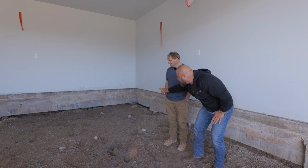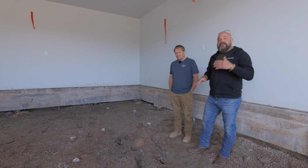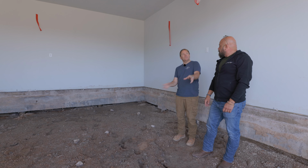We'll go in and we'll clear out a little bit more, give us about 6-8 inches underneath this, and then we're going to come in here with just gravel. We're going to gravel it because the point being that we want to create basically a river to let the water through. Like a home in Malibu, just on piers, the water's just going to come in and out.